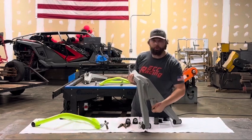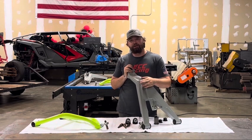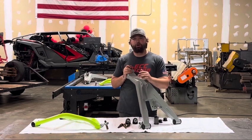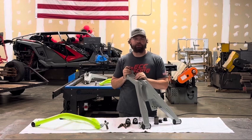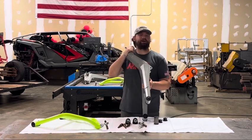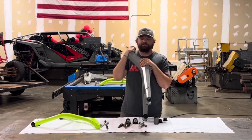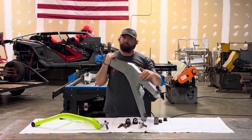Our lower for the Pro-R and Turbo-R is made out of a mixture of 11 gauge and 3/16ths. The shock mount itself is 3/16ths and spans roughly 75% of the arm. This allows us to more evenly distribute the dynamic load that the lower arm sees throughout the suspension cycle when you're crashing through whoops or hitting rocks. We knew that because this is a super high clearance arm — it's the highest clearance Pro-R arm on the market currently, and honestly as high as you can go before you start hitting the axle — we knew these would be touching rocks.